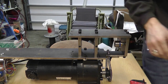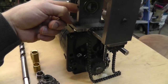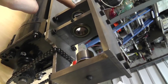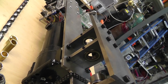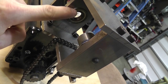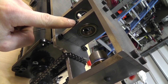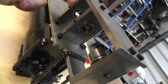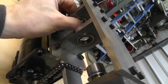I've got two bearings inside of here. I machined all these blocks together so I knew my center was exactly the same, then I took a fly cutter and cut the bearing housing out until I got it to fit the bearings just right. I've got just a little set screw here to hold the bearing from falling out. These bearings I got out of an old copy machine — you can see how the races are burnt from the hot roller element.